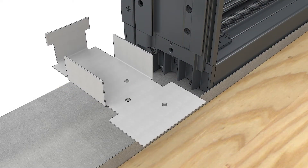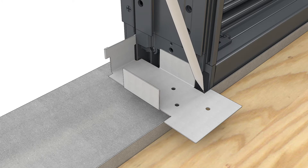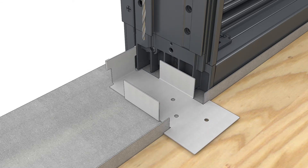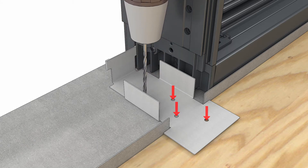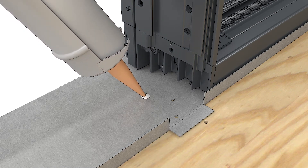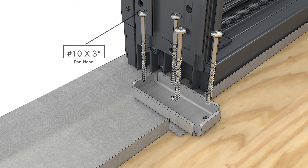Place the tube steel fixture on the sill. Position the fixture so that the turned-up and hemmed leg on the fixture fits into the frame curve. Make sure the fixture fits flush against the sill corner key. You might need to notch the upturned leg on your sill panning and lay the resulting flap down to support the sill bracket. Using the holes in the fixture as a guide, pre-drill into the sill, then inject sealant into the fastener holes.